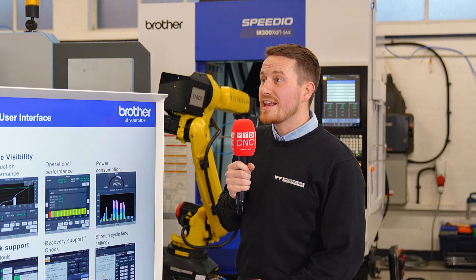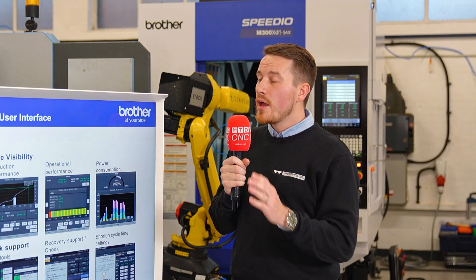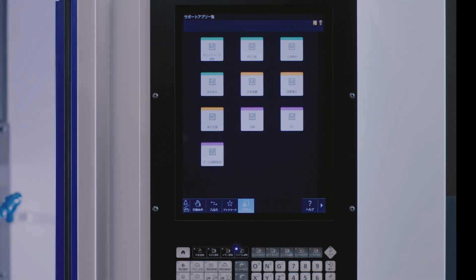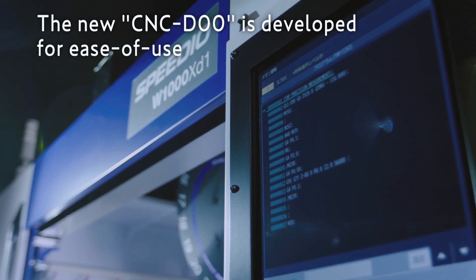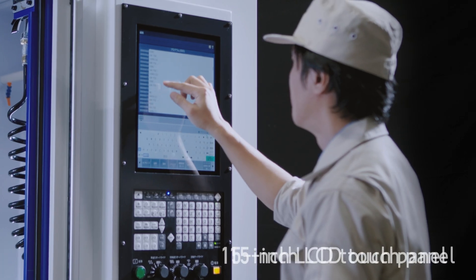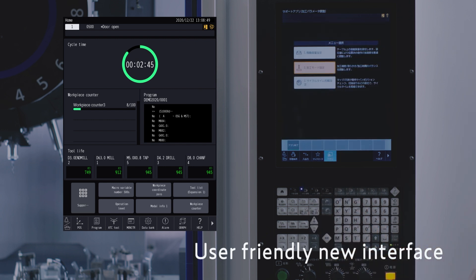It's not the Achilles heel — we've got advanced read-ahead, so we can see ahead of the actual program and apply accuracy settings on toolpaths. This allows us to apply an apex to a surface if we need to harness even further cycle time decreases, so all of these little wins allow us to take advantage of decreasing that downtime.